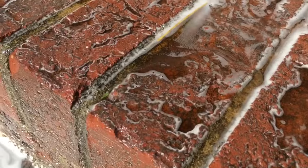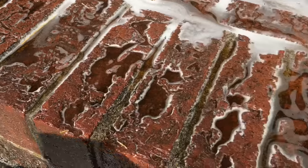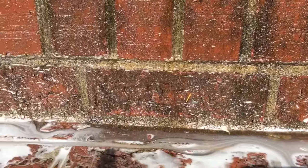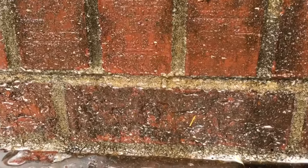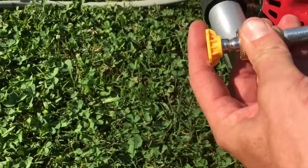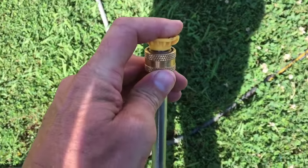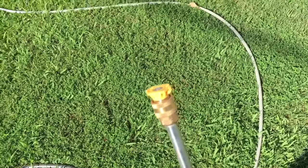Keeping it damp. I don't know if you can see that, but the water is kind of turning tea-colored there, and that is the stuff doing its job. You can see really how black this is — that should be a red brick right there. I'll compare it to the bricks up there and then do an after shot of how much cleaner this will get after the pressure washing. So that is a 15-degree nozzle — snap it on the quick connect here. Always make sure that this thing snaps all the way back, otherwise when you turn this on you will shoot your pressure nozzle all the way across the yard, hopefully not breaking any windows.